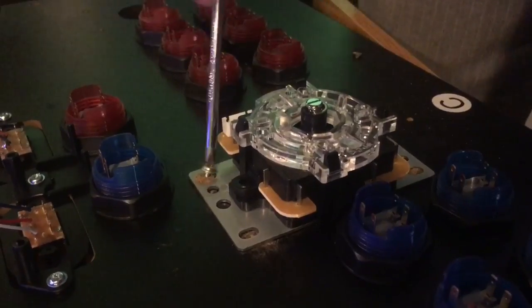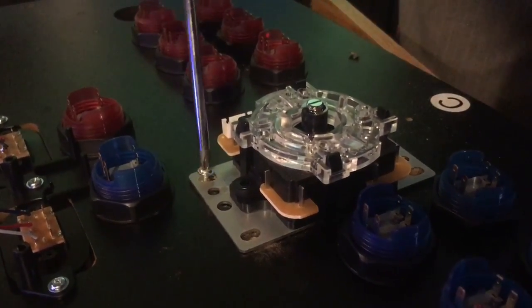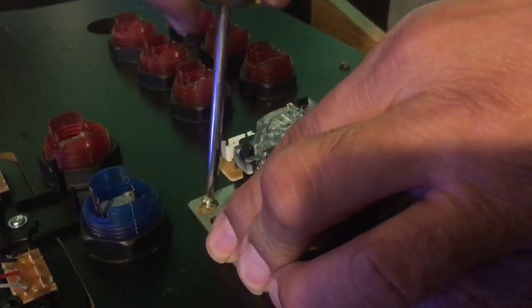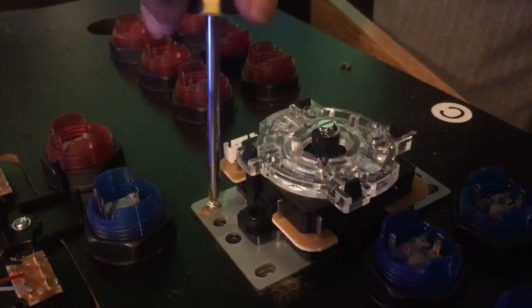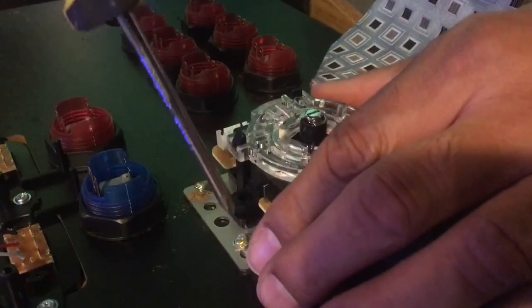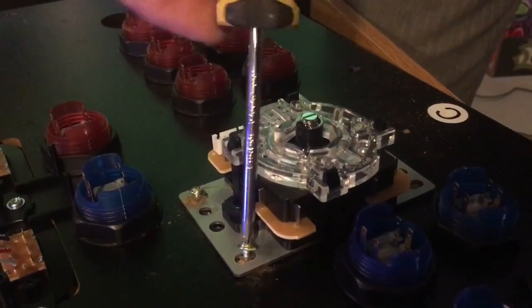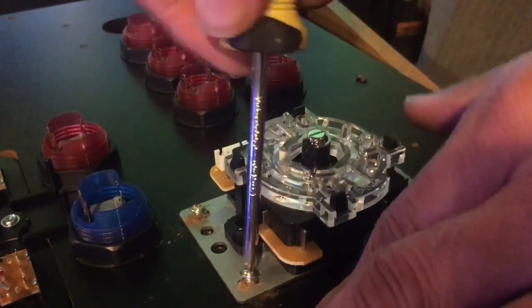And so with that bottle cap in there, it holds this thing in place really good. You drill your holes and then you just screw them in. Doesn't take much effort here. Well, actually, it does without those screw holes. You see, I'm fighting a little bit with a couple of these holes because you've got to get the right size hole in there. Otherwise, you make your job a little more difficult than it should be. Use that tape on your drill bit to make sure your holes are the perfect size.